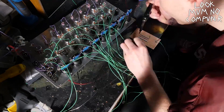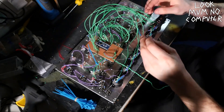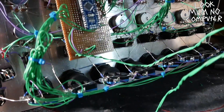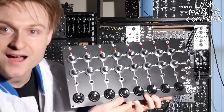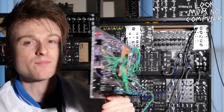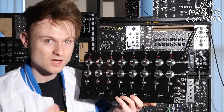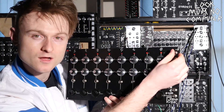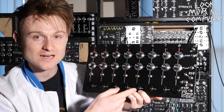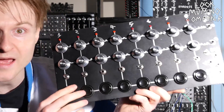The standoff pin is used to mount the PCB to the panel. After all of that — it's done! Loads of wires in the back, a bit spaghetti junction, but cleaned up. This one does a lot more than the Baby 8 sequencer because it's Arduino-based — you can code it to do whatever you want. I've made it so it can go forwards and backwards, it's got a keyboard on it so you can select steps manually, and when there's no clock going in you can use it as a keyboard. Let's plug it in.